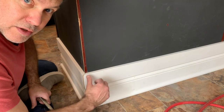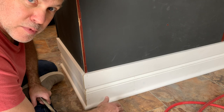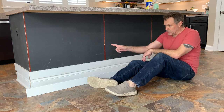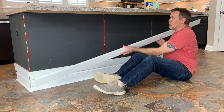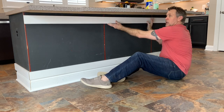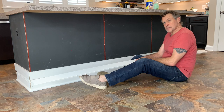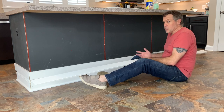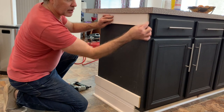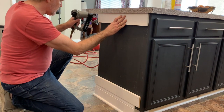I took the edge down there just a little bit. You can see there's still a little bit of a gap — I'm going to fill that in with wood filler as well as the nail holes. Once that's done and sanded down, it's going to be nice and smooth, ready to paint. The next step is to replicate what we did on the bottom with the long piece and the two side pieces of trim, up here at the top with one more long board, 45s at each end, and then a piece at each end on the top with a 90 degree cut on the front end, same as we did on the bottom. Then we're going to put in our vertical pieces and we're wrapped up. This is certainly easier when you can get a little assistance — you don't have to wrestle the board so much.